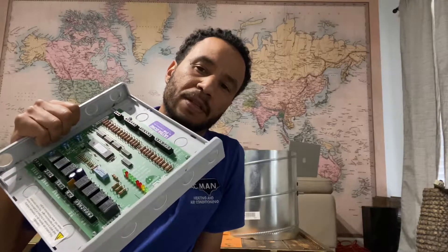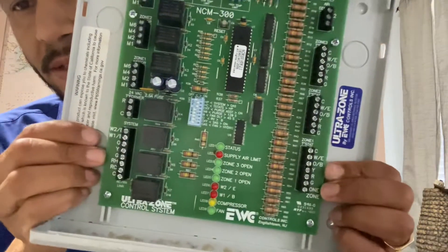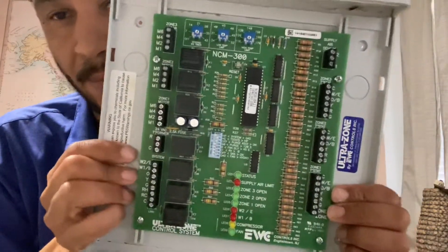I recommend you watch this video two or three times or just rewind it so you can get that in your mind. Now let's talk about troubleshooting. Say you turn the first floor thermostat downstairs to cool and the condenser is not coming on. Normally, if you had no zone board, you would go up to the air handler and check Y and C to see if you have 24 volts up in the attic or crawl space. But in this case, you are going to check the first floor thermostat — the one you turned on.